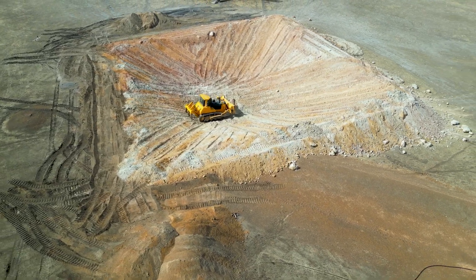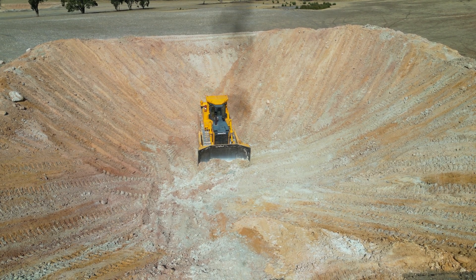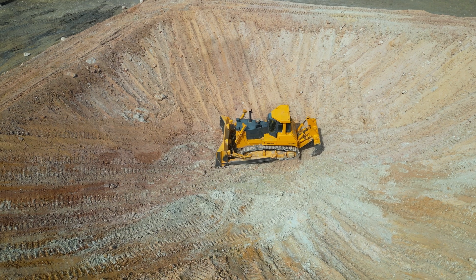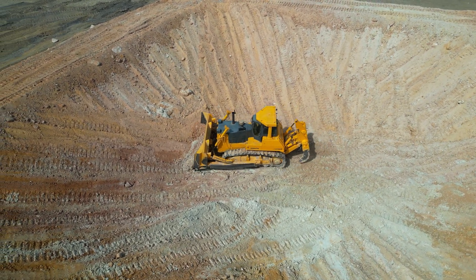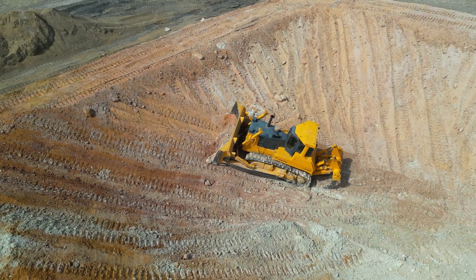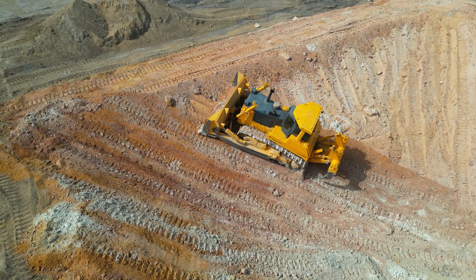When we're talking about seepage in sandy areas, can you tell me a little bit about that? Basically, they're only a soak site. It really depends on the recharge area above it for how much seepage water you're going to get out of that site, because some of them just have a reservoir of water there and once that's used up, it's gone. You're just digging those with an excavator or a dozer. Sandy stuff — lay the batters out pretty flat so the stock aren't carrying too much sand back in.